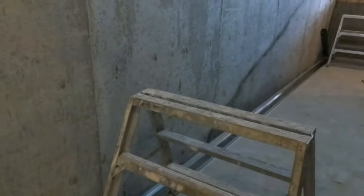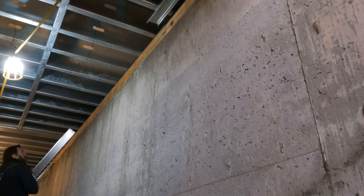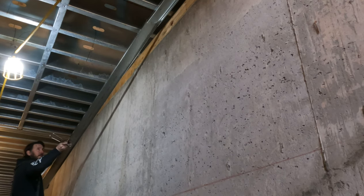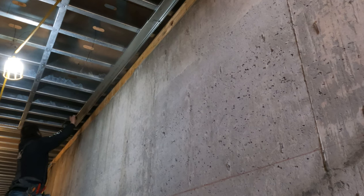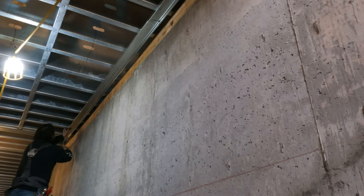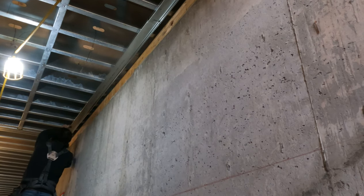You can see I have multiple lines because the wall is not straight — you have to play with it so that no matter where the farthest point sticking out is, you still have that one inch. In this case the foundation was really bad, like two to two and a half inches off. I use two pin lasers to get my first track in. I cut a fishtail — one end is already level, I clamp the other side to a pin laser and screw it all in. Super simple.